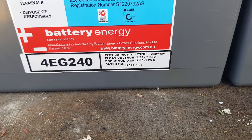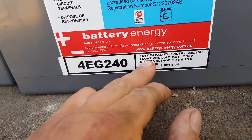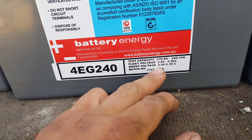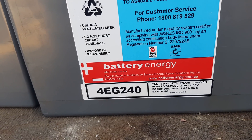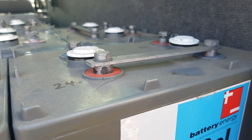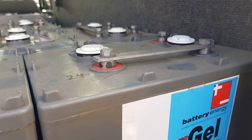The 10-hour rate is pretty standard for a normal battery. It's 2.25 to 2.3 volts per cell, which is nice, and 2.45 volts at 25 degrees C when you want to boost them — that's awesome. The next really cool part is they come pre-linked into four-volt units.